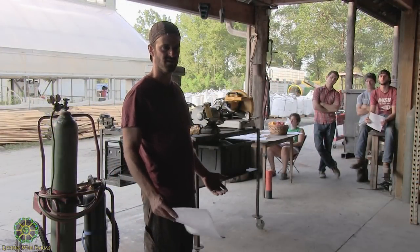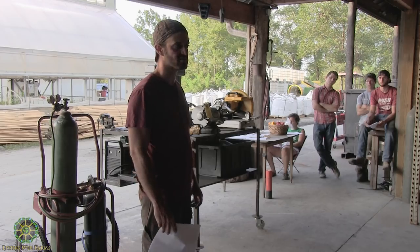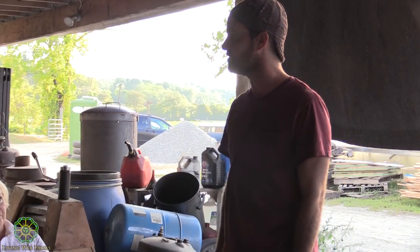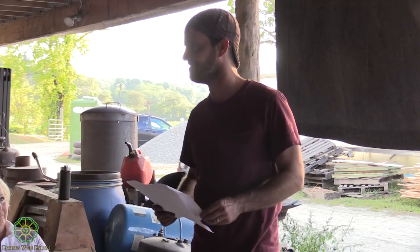These welders are actually pretty safe. I've never been shocked by it, but there are always precautions to take. Don't stand in water and do it. We wear nice boots with rubber insulated soles, for what it's worth. That keeps you from being grounded. Basically, don't go barefoot.